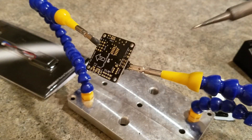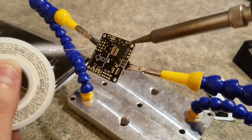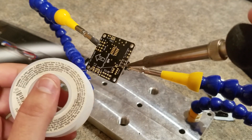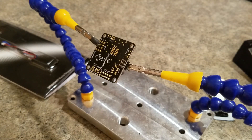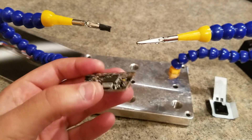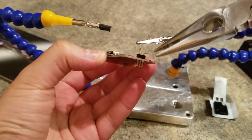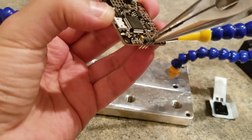I got my normal sharp tip back on my soldering iron. I set up my three pin header here on my helping hands and I'm going to put that on the flight controller first. Make sure it's flush against the board to have the least spacing possible between the receiver and the flight controller. Now we're going to want to bend these pins up vertically to put the receiver on. They don't have to be perfectly straight as long as you can slide the receiver through.